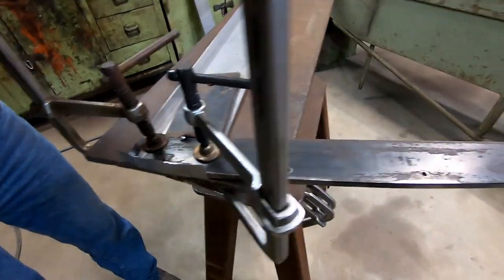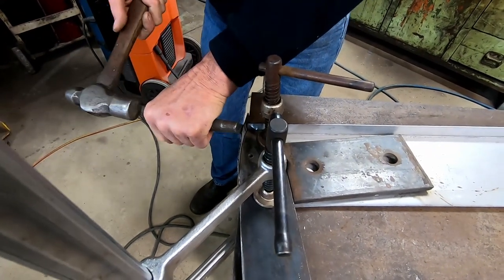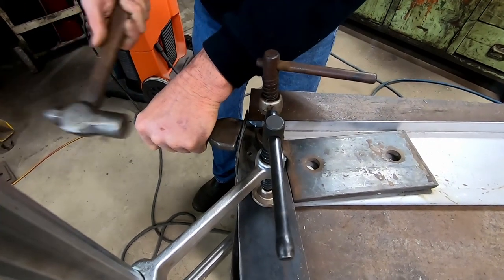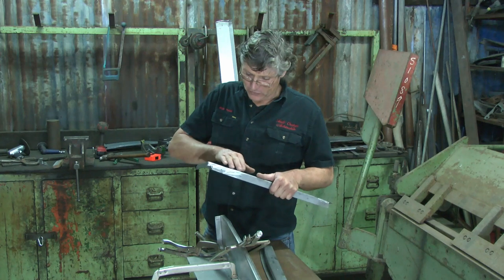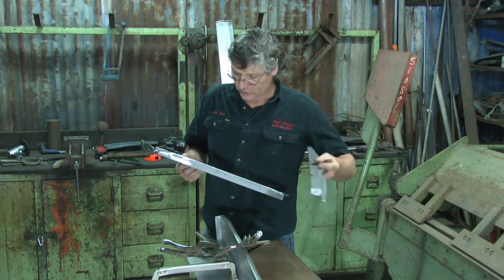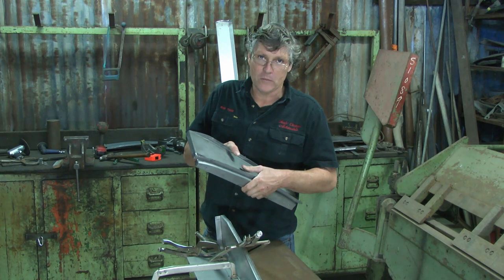A little bit looking from this side. I'm just getting ready to weld together our left-hand panel with this little area here where I've got this little curved recess in it, and that is to fit the little recess panel for the tailgate into. So, as with the right hand side one, we've got to get these two to fit together perfectly.